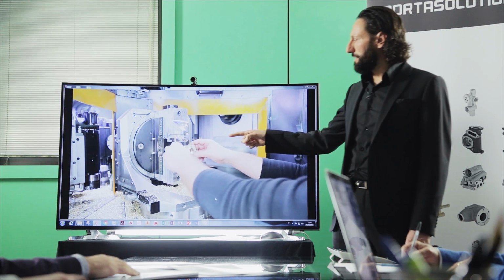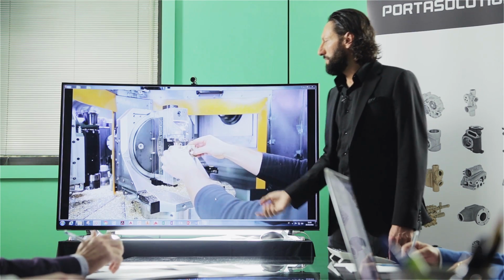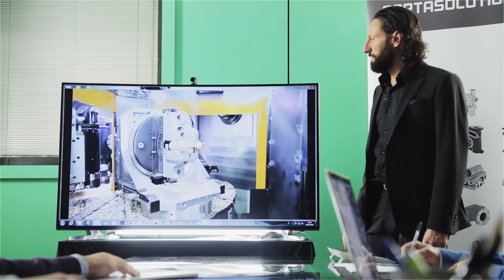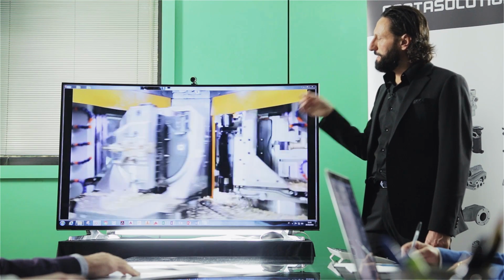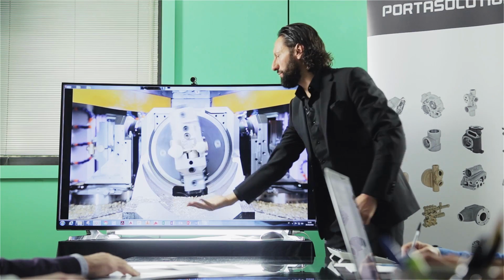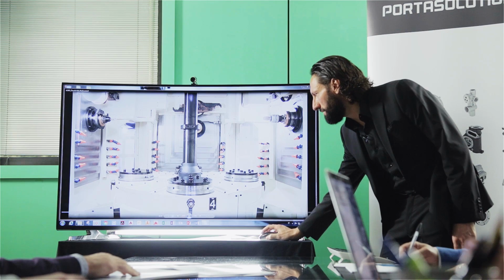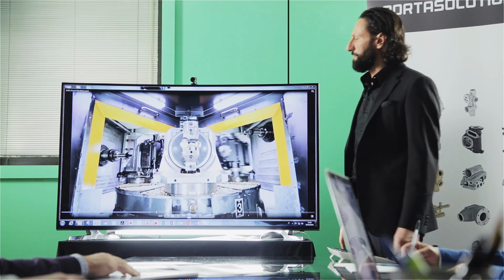Now we have a horizontal spindle, you can machine all around, but you cannot machine the top and the bottom. So in order to do this, the fixture has the capability of indexing 90 degrees. So your top operations now go horizontal, and now with your B-axis, you can again reorient it and machine it. I'm going to skip this part and show you directly what's happening in the machine